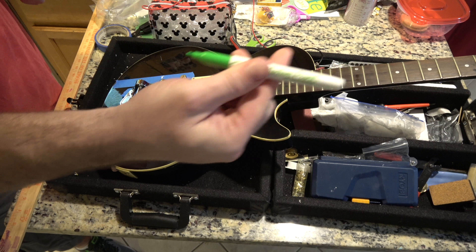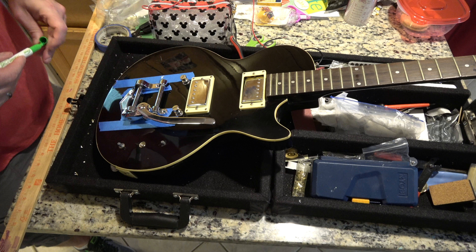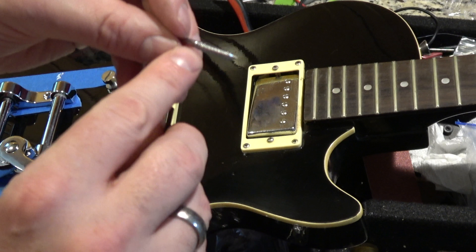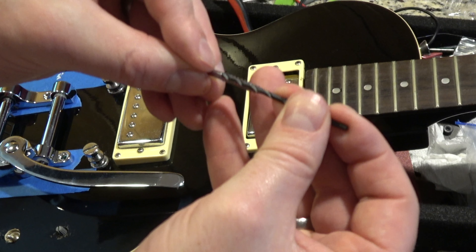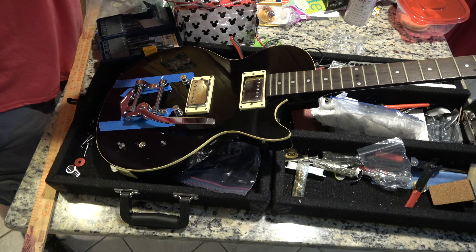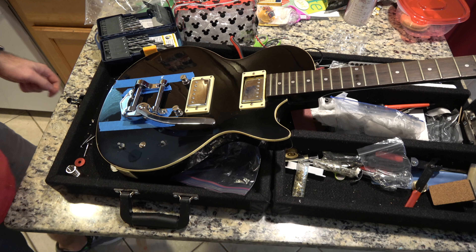When you want to do a drill bit, one of the key things to know is that like the shaft of the screw — the threads are the circular outer part. You want to make sure your bit is about the size of the shaft of the screw, but the threads of the screw come out beyond that. That way it makes it easier for the screw to go in, but there's still some material left for it to cling to. Also select the depth of your screw so that if you get a little over eager, it doesn't go all the way through.